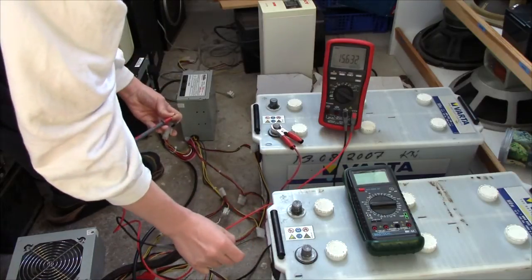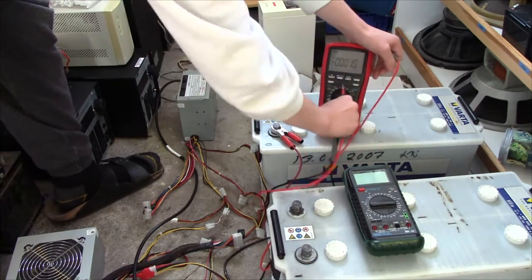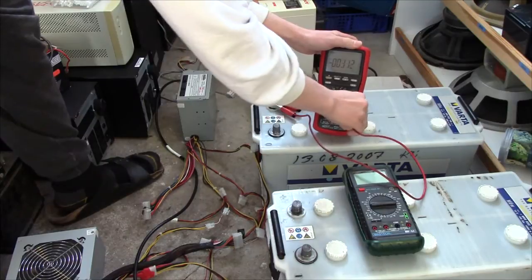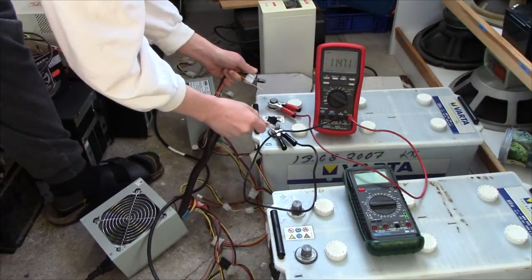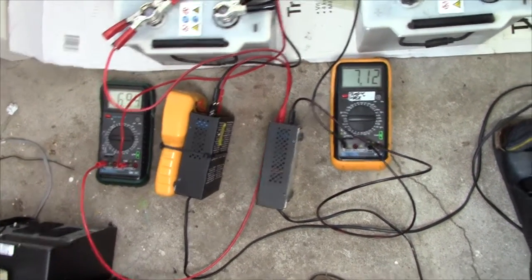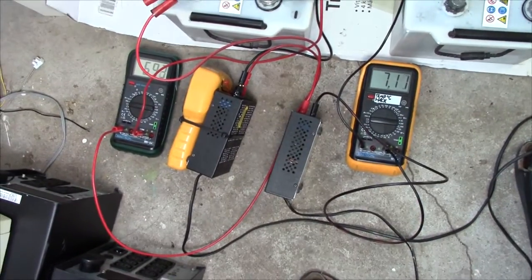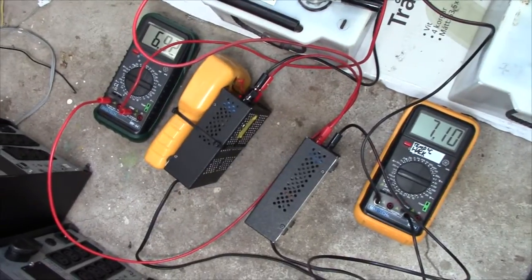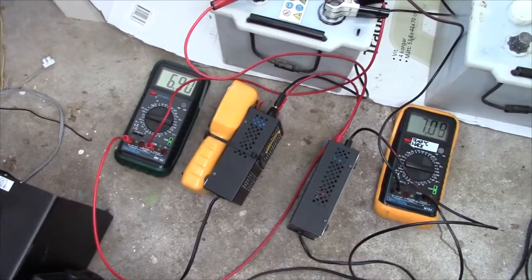Here's an experiment: can you use two cheap power supplies wired in series to charge the truck battery? They don't have very thick wires, so there could be enough voltage drop for it to actually work. These two chargers are charging at about 7 amps apiece and drawing 226 watts from the grid. I did some math: these two chargers, while charging this battery, are 77% efficient. That amazes me because these things are almost 30 years old - I was expecting them to be closer to 60% than 80%.